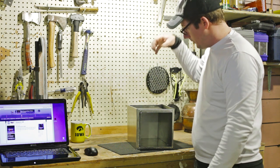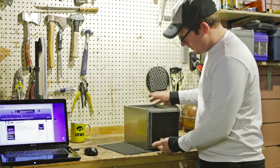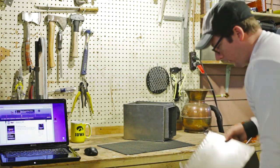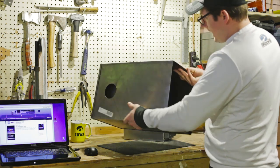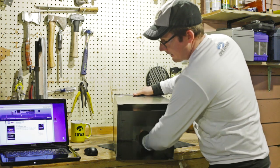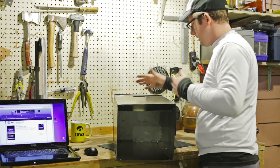and then make a little stovepipe collar so that I can put a stovepipe on top, and this will be more or less airtight, and smoke will have to flow around the oven and heat it and then out through the stovepipe. And you can see where it'll sit. I cut a 3-inch hole towards the back of my finished stove, so the smoke has to go like this from the back of the oven towards the front around this baffle, heat up this stovetop surface for cooking, and then it'll come out this hole.